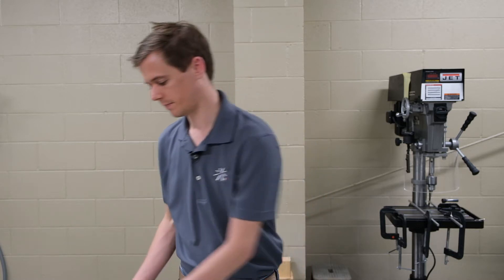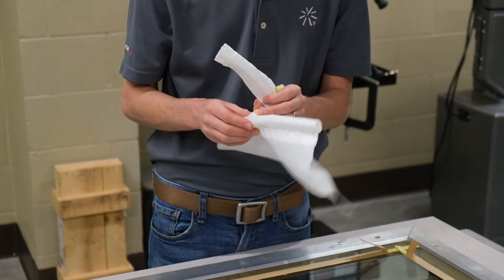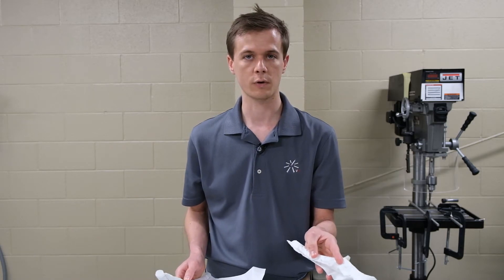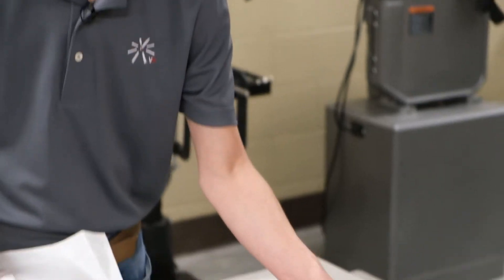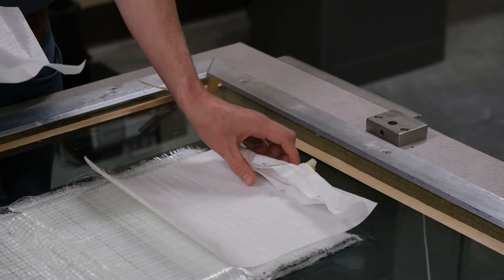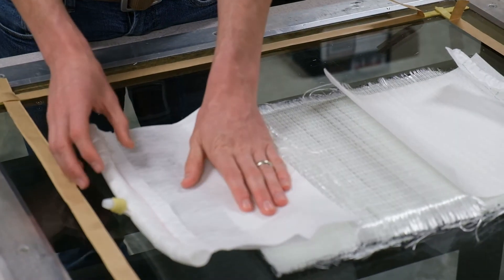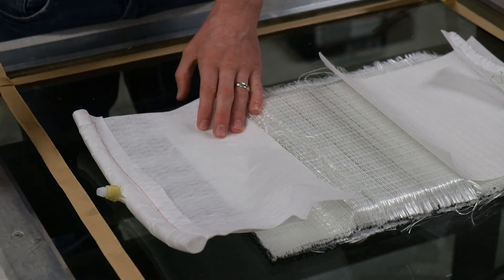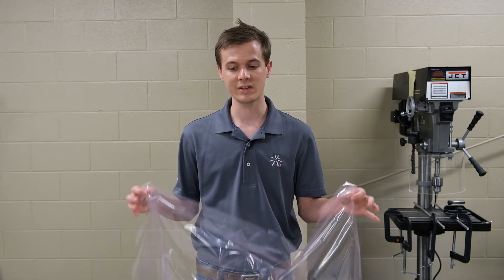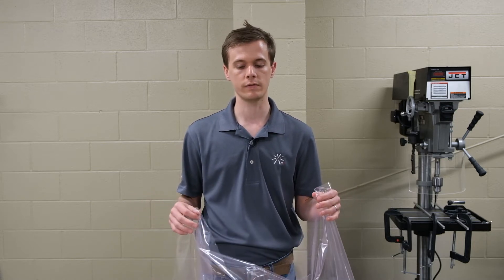Next, we're going to add our feed line and our vacuum line using this pre-made material. I've gone ahead and added a piece of tacky tape to each of the tee fittings — that'll give our tubing something to stick onto and prevent a little bit of vacuum leaks. This is our feed line — green for go. It's got a piece of peel ply on the outside so it'll release nicely. We're just going to put it right on top of our flow media, making sure we don't have a gap, otherwise our resin won't be able to get to our part. For our vacuum line — red for stop — it has a little bit of a tail. We're going to put about half of it onto our part and half off, which gives us a little bit more of a resin break between our part and our vacuum line and keeps us from filling up our catch pots. Our bagging film is a little bit oversized for the part, which is actually a good thing — we want a little bit of room to work to pull over any curvature in the part, and it's easy to tape up with pleats at the end.